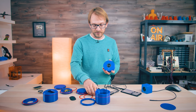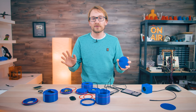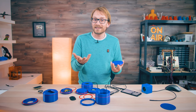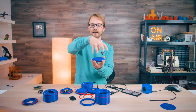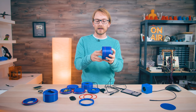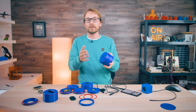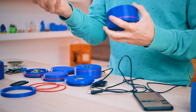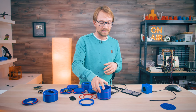These three different drivers aren't everything you can use with these — the entire thing is open-source. You can get the full Fusion 360 file and STLs linked below, and adapt your own drivers and wishes to this platform. If you want a driver larger than what fits into this thread size, you can just flare it out and add a larger piece on top. You can also experiment with different ports, different enclosure lengths, smaller diameters adapted to PVC pipe — it's all up to you. This was intentionally designed to be super simple to rework, with no involved math required.